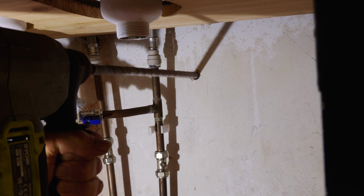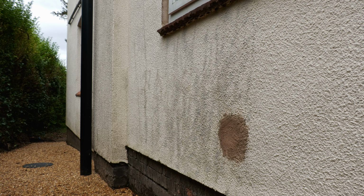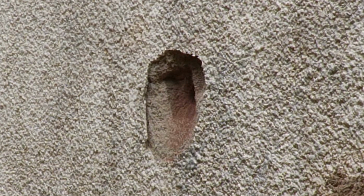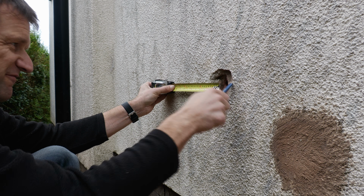So I drilled the initial hole from the inside and was too lazy to look for a narrower drill bit than this 16mm SDS bit. This was an error because my Tyrolean render is notoriously liable to blow off dramatically if not carefully drilled, and this time round it didn't disappoint. Let's watch that again as a close-up. No! Interested to see how I recover from this one.